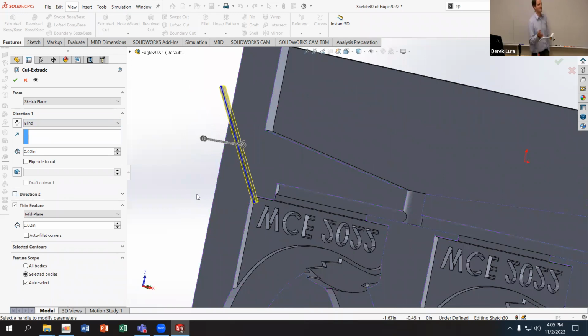And the only thing I'm letting escape through here is air. So it does not need to be big, right? Air is not viscous, so it doesn't really matter. In this kind of case, if it's gravity fed, this is not going to fill super fast, so it's not going to be a problem. You would include a vent like this even if you are doing a very high pressure injection mold, but the thickness of the vent might be microns because you're injecting under very high pressure. And so that air is going to come out. It's more just like a scratch in a very specific location to allow flow in a specific area.